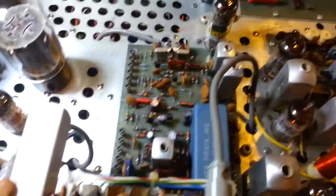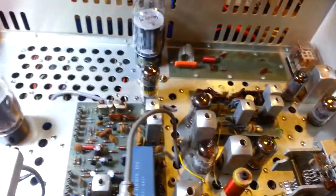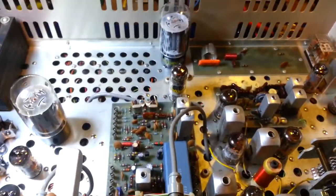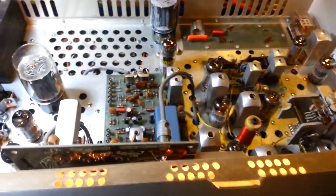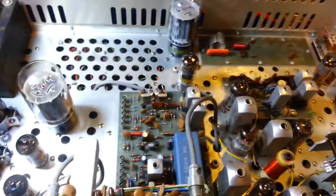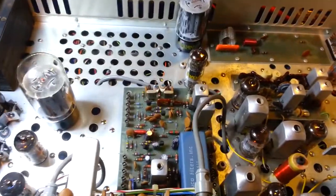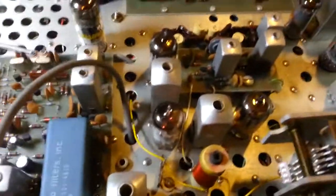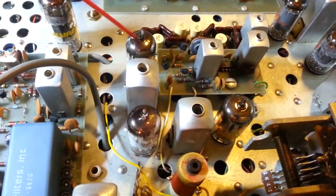Of course, everything was cleaned up here in the board. All the dust bunnies were removed. One vacuum tube was changed. That's this one. They were all tested on a Westmore 501, which is just a GSA contracted Triplett 3444 laboratory mutual conductance tube tester. All the tubes tested in very good condition. This one was a little bit low, but that's not the reason I changed it.